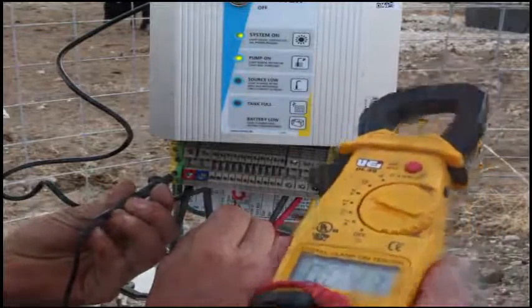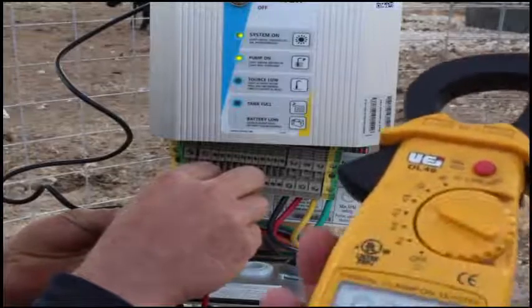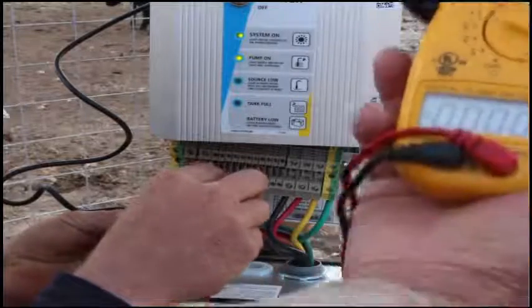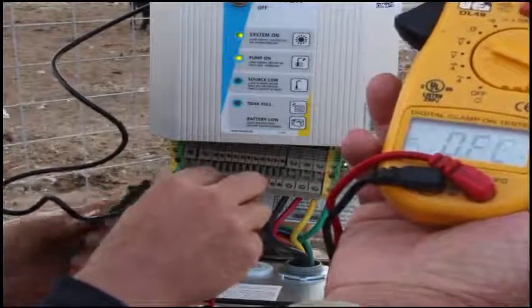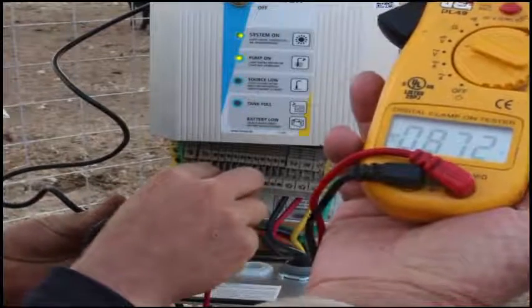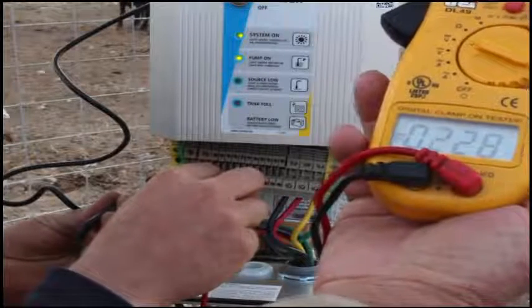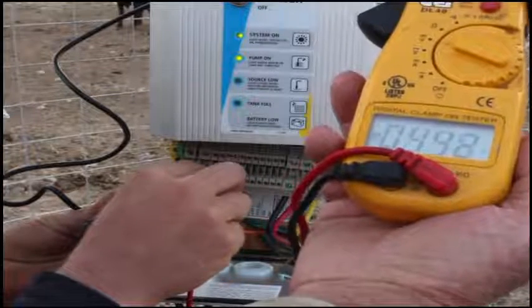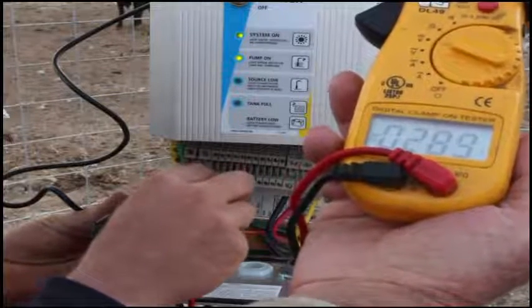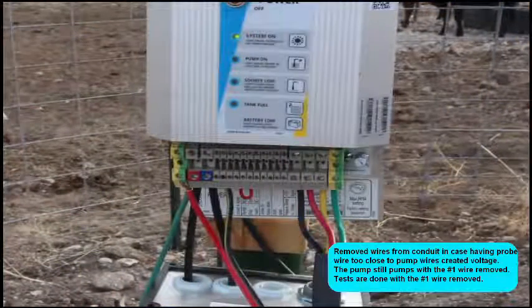I don't think so. Alright, testing between 1 and 2 on the strip, 0. Up just a little bit, Bruce. There you go, perfect. Okay, and between the number 2 slot and the back, that can go to ground like we're supposed to. Anything? All over the board, but less than a volt, from 0.2 to 0.6. And from the number 1 slot to ground? Same. Okay.